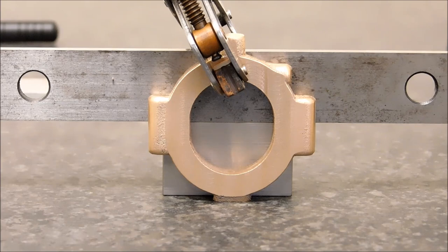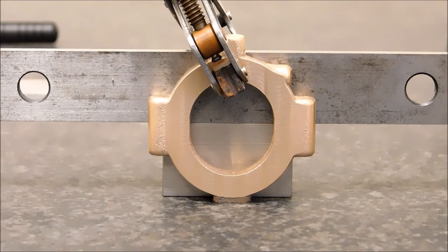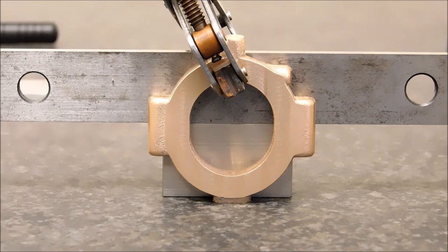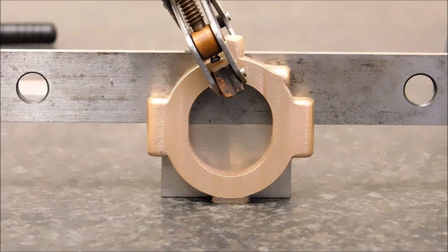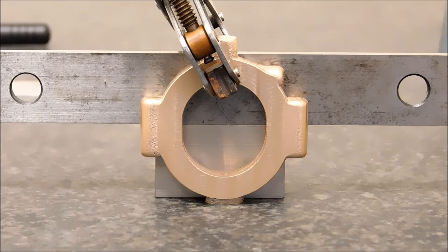So by putting this across a bandsaw on that line, if the saw does not cut wider than 1/8 of an inch, you're in good shape. Well, if it does, get a new saw. Then all you need to do is join the two halves and bore the center out once you've decked off those two saw cut surfaces. All right, mine worked out to 800. Yours may work out to something different, but this is a good solid technique for scribing a line.